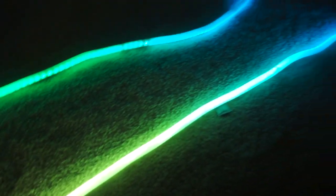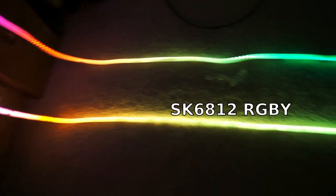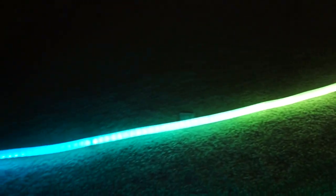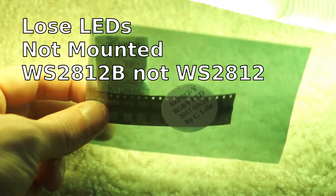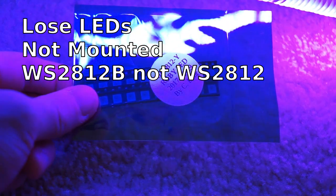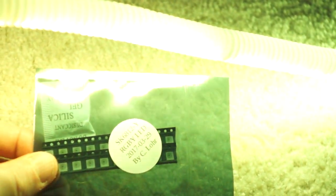What I really like is this here. I found a provider that instead of trying to get the right green, they just decided to give us a yellow channel. So this is a SK6812 strip, and instead of it being RGB or RGBW, it's RGBY. And it produces the most beautiful yellow I have ever seen. I'm going to buy a couple more of these, but in the meantime, you can buy them off of me on eBay for $9.99 a pack of 20. They're the same form factor as a WS2812, but a little bit different timing, but it's totally worth it to get something that is as beautiful as the amber yellow that these LEDs come with.